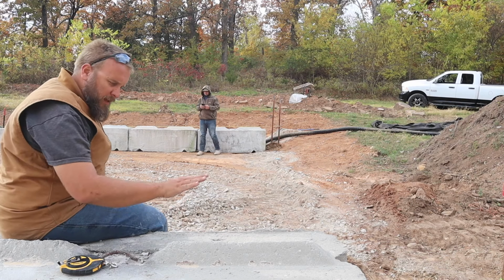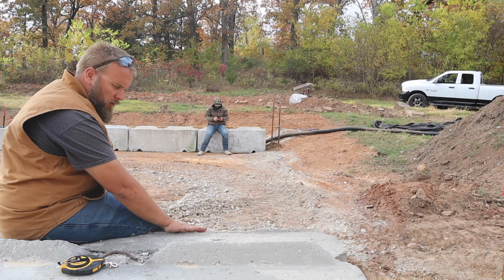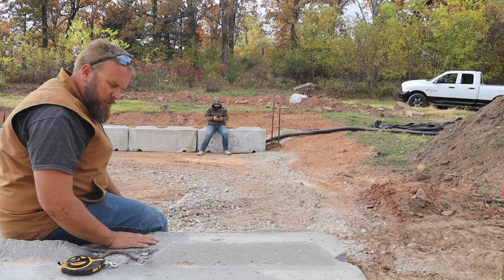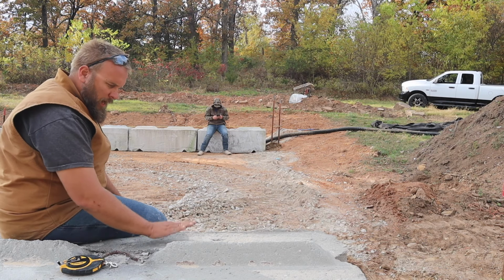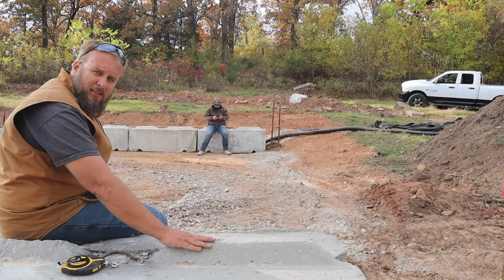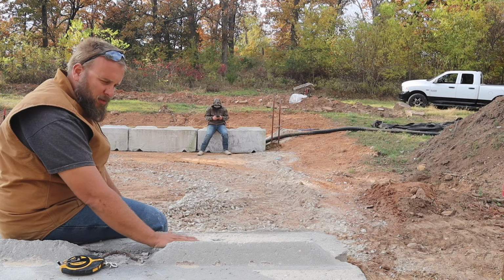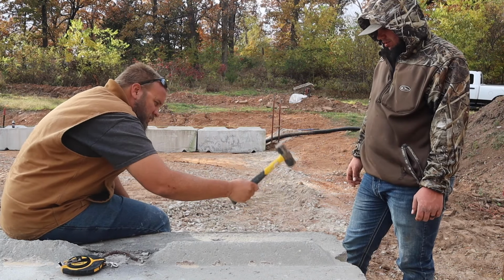We've got a track that bolts on right here and hangs over this edge, and that's what the wall sets on. The wall is actually 7 inches wide, so I think this is going to work really well right here. This raised area is going to give us something to butt that track up against, so it's in the same place all the way down. I'll have to go down all the block and do this.